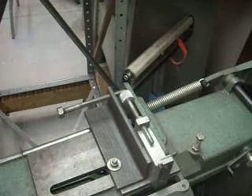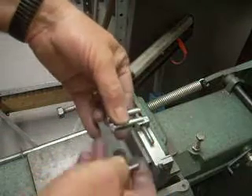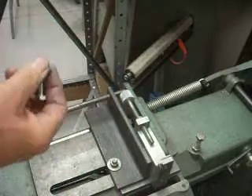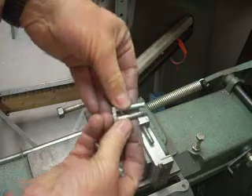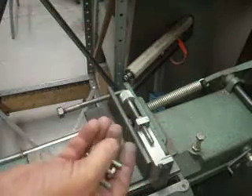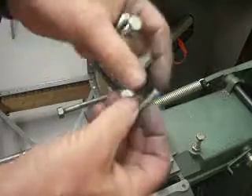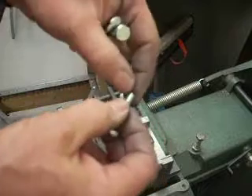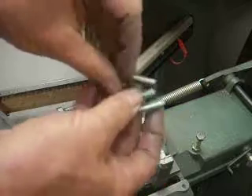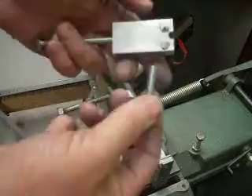So now we have our three bolts. They're all cut to exactly the same length, and hopefully they're the same length as the bolt we wanted to duplicate. The next step is we want to bevel these — also called a Higbee. You just want to bevel the thread; you don't want to bevel the body of the bolt. On a quarter-20 bolt, that means seventeen thousandths of an inch is all you need to take off. So I've got this fixture.